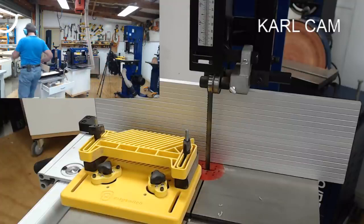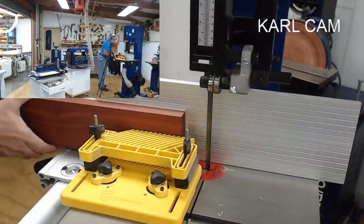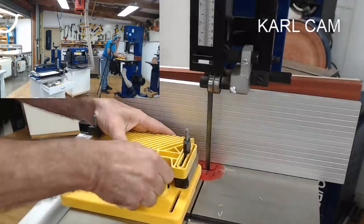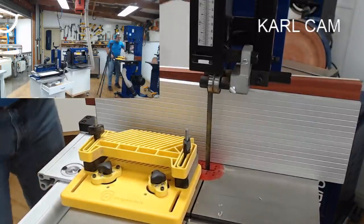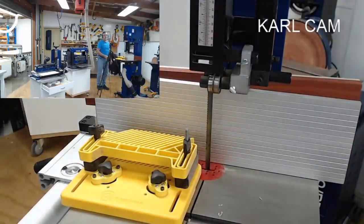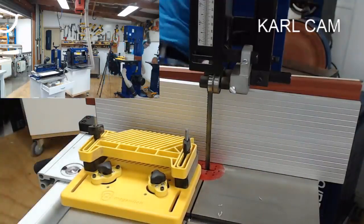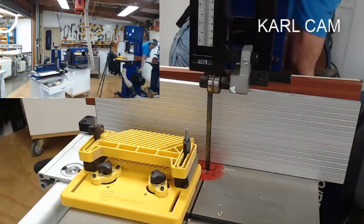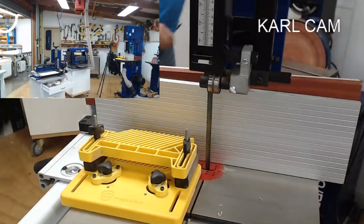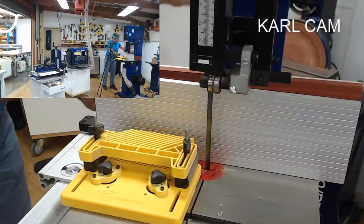All right, I'll come around the back. I've already got all of this set up, so hopefully it's going to perform very nicely for me. I'll just tighten that up a little bit more. That's better. All good. I've got the tension on the blade. Always, always a good idea, tension your blade before you start your saw up. Do all that. Plug it in is the next thing. I thought I'd prepared everything, but, nah. Done. Here we go.